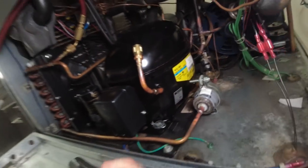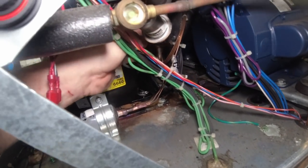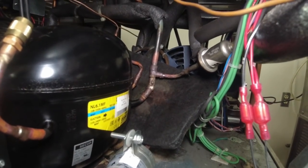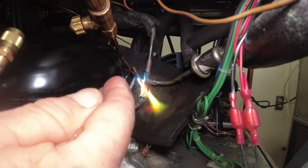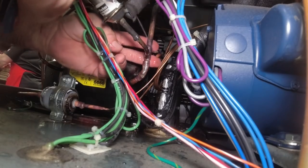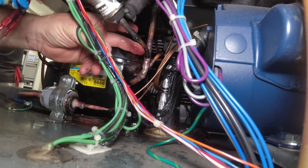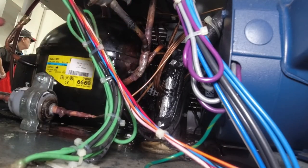Got to re-insulate that one tube in the back — the tube that goes from the top to the bottom. We've got a leak somewhere — it's on the back side. Getting our insulation pad in there to block it should let us get to that joint without worrying about burning the wires. It ended up being a joint on the very front that just didn't pull in for whatever reason, but it's holding good now. Sometimes it just doesn't work out easy when you can't get in there.